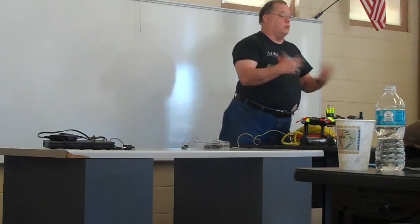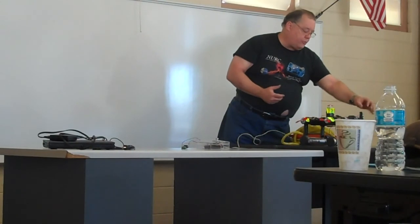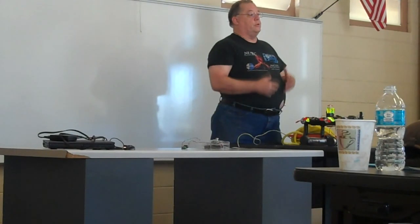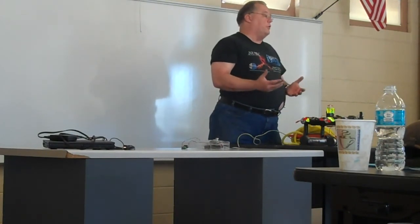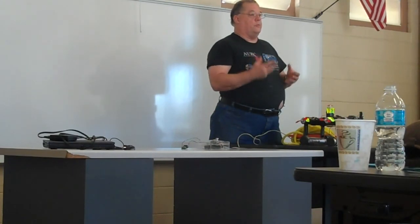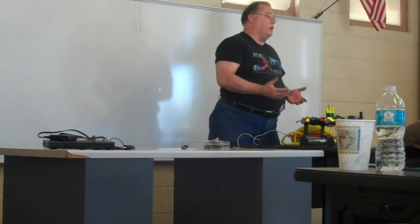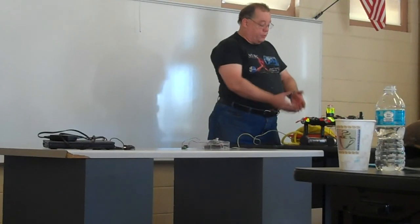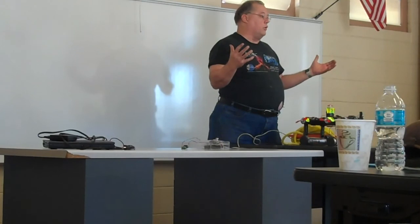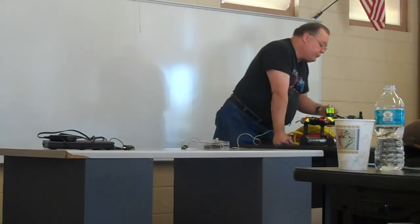The lighting comes from inexpensive Harbor Freight LED flashlights. You remove the aluminum and put two of them in series with a water-cooled resistor in series to limit the current. I discovered that Harbor Freight makes them so cheaply because they rely on the AAA batteries being too weak to provide more current than what the diodes can handle. So when you put them on a much more powerful source, you have to put in a current limiter to make sure they don't go over current, burn up, and fail.